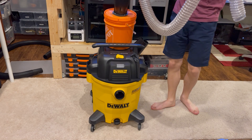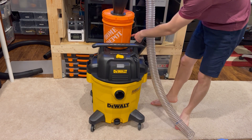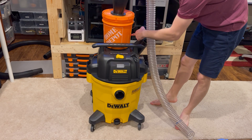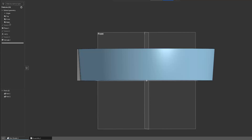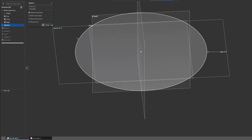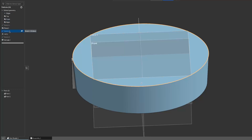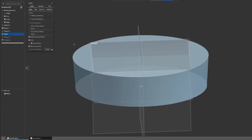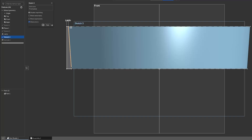What we're going to be doing is making a custom mount that attaches to it, and we're going to try to make a clamp that goes around the bucket and gets located between those two posts there. Here is our Onshape model that we're using. On the bottom we have the bottom dimension that we measured, then above it we have a plane offset by 50mm, and then lofted together, giving us our angled piece that we'll use to measure it.